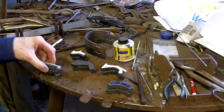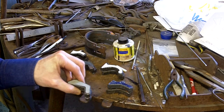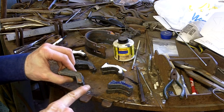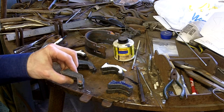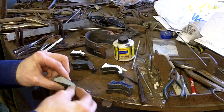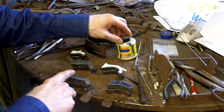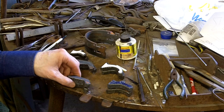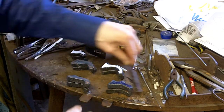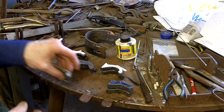I just cut out five pair of shanks and I needed a pair of cutter shanks. This is the tin pattern that I've got there. What I'll do now is belt sand that with an 80 grit belt on both sides there, clean that up, and then I'll use the Dykem layout dye — daub a thin coat on there, let that dry and set up good, and then I'll use a scribe or a sharp awl to mark around the tin pattern or the cardboard pattern, whichever I'm using at the time.